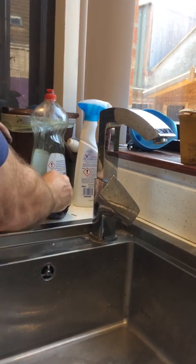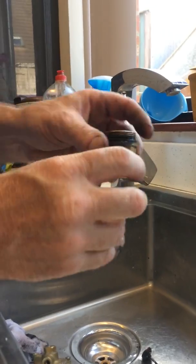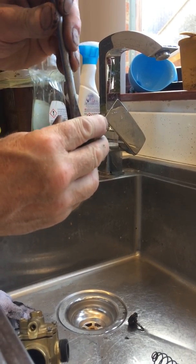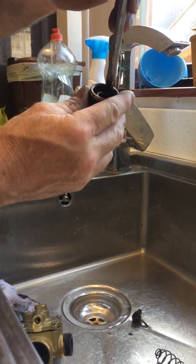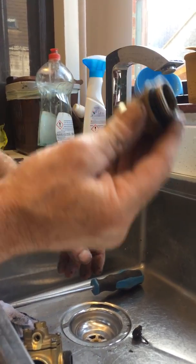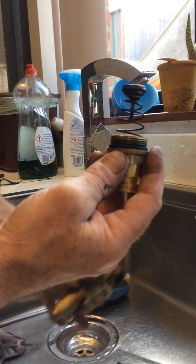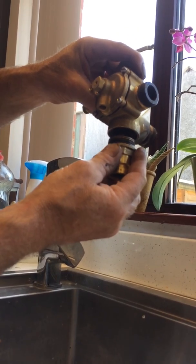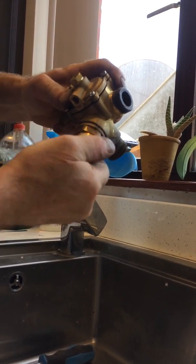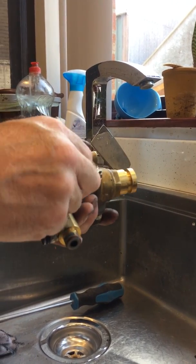Pretty dirty. To reassemble with the new parts — I'm not too sure how to get this part apart. I think this is the bypass and it's kind of spring loaded; I think it unscrews but I can't get it free. I'm not sure whether that comes as part of the fixing kit. Anyway, put the spring in there, the new bobbin would be replaced on top of the spring, mount it up into the valve and screw it in — as simple as that. That's the back done.